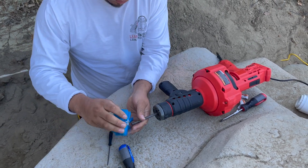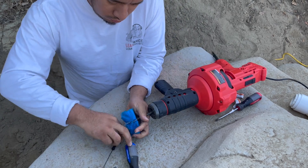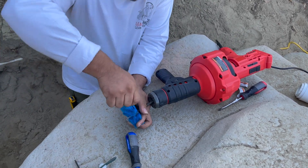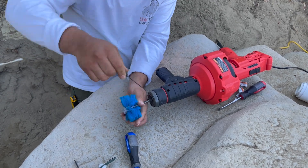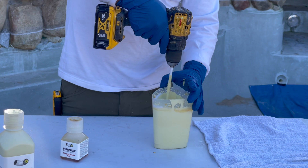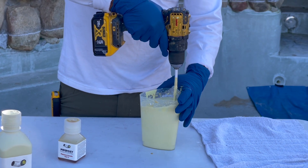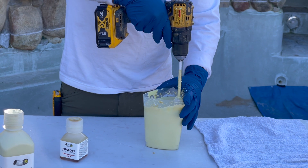Next, we're going to set up our brushes — our brushes go on nice and tight. After the brushes are assembled, we're going to start doing our epoxy mix up. We mix up parts one, two, and three, and we're going to pour in the right amount going by our chart of distance. So here we have a two and a half inch pipe — this is a large diameter pipe.